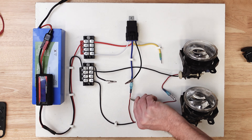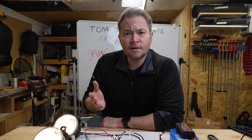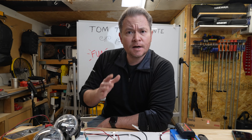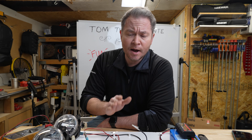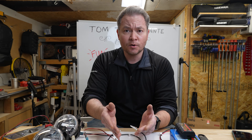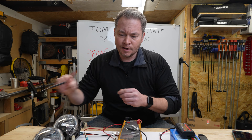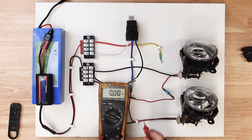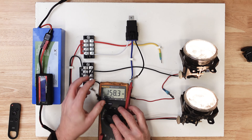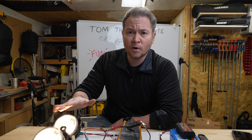Let's put them both back to trigger on the normally open position — in other words, they're going to turn on when I energize the relay. With it connected this way, we can see that these two lights are drawing about four amps. Earlier I mentioned that I could switch this four-amp load using a very low-amp switch. To test that, I'm going to use my trusty Fluke meter set to the 300 milliamp measurement and connect it to this circuit to see how much power the relay draws. Here you can see it only takes about 150–160 milliamps to power this four-amp load.